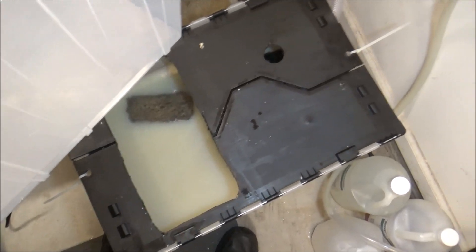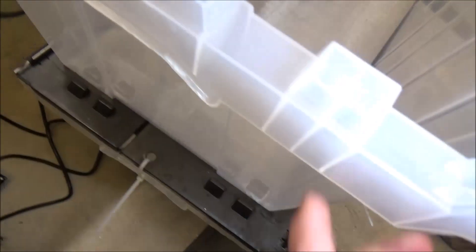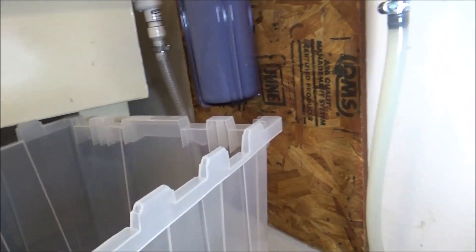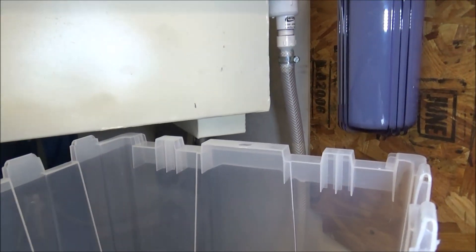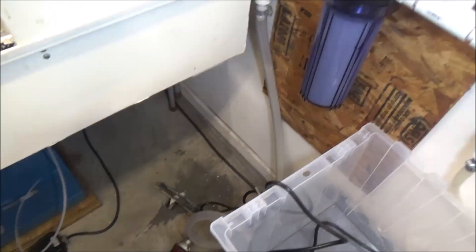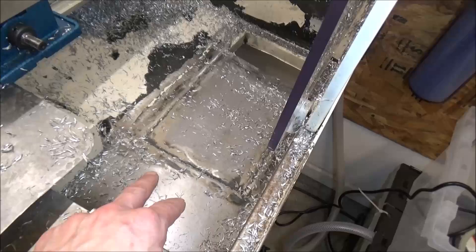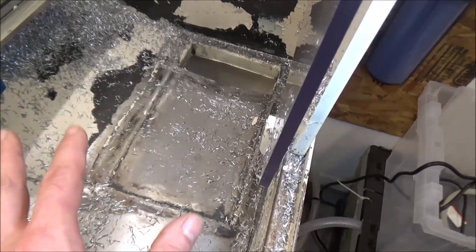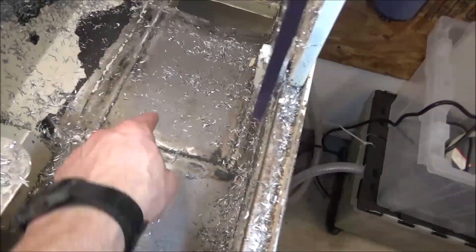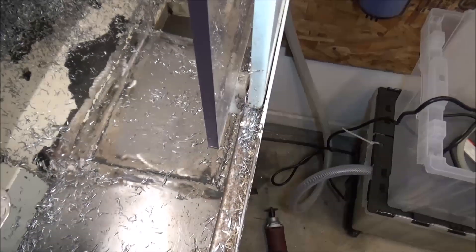With the pre-screening that should be good. I've got the tub just sitting on — I didn't change the coolant tank at all, just rerouted the hose to come out the end instead. These tubs kind of lock on each other, so that should be okay, and the height for my particular situation is just perfect — it'll slide right up under there. Next I just need to cut the bottom out of my tray. You guys who follow my channel know I struggled trying to TIG weld this pan up to patch this area and prevent coolant leaks — well, now with the flood coolant I probably could have just left the big hole.